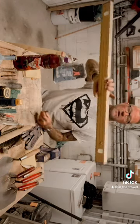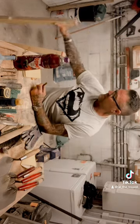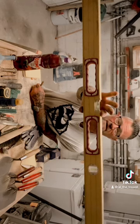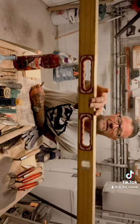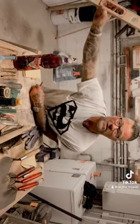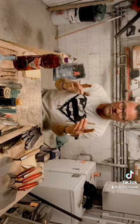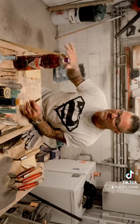Levels. I use Stabila. This is a 96-2 model, I think. That's not four foot, but I've got obviously four foot, two foot, six foot. You don't need that. You need a four foot level. There's a four foot Stabila with ribs - that's a 196-2K. Obviously with these handles he's got a couple of weaker points, but they're handy. Four foot level, that's all you need, apart from a bone level which is a small little level, for anything from eight to twelve inches long. You don't need two foot and all that at the beginning. Four foot Stabila level - it's the only one I recommend.